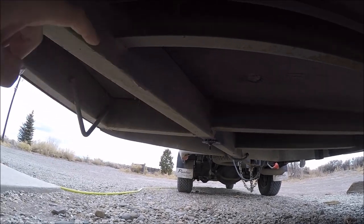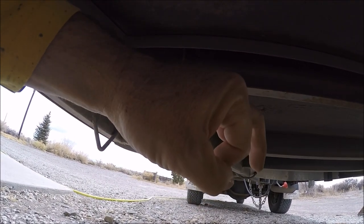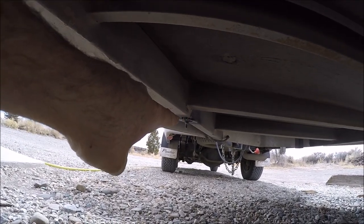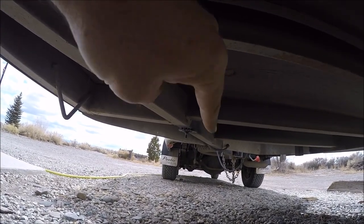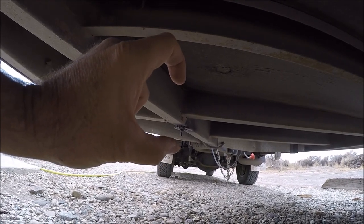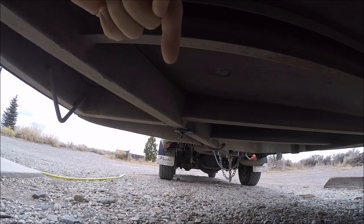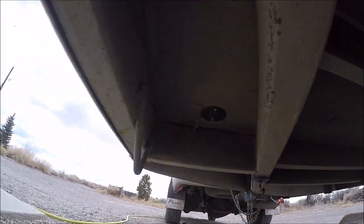My wiring goes down here - I have a big wire loom that's all wrapped in solid plastic on the outside. What I did was drill a bigger hole and shove it to the side. On top of that washer-and-nut combination, I welded a post - just a little piece of square tubing that sticks up about this high - to keep the wire loom away from my bolt when I drop it in. The wire lays beside it, and when I drop the bolt through, it just drops right into that little square tube and lines up with the hole. Not the prettiest everywhere, but it is working.